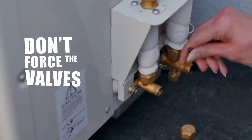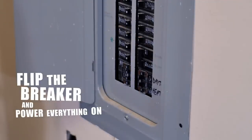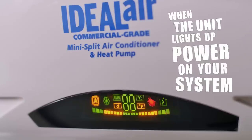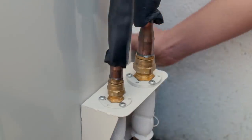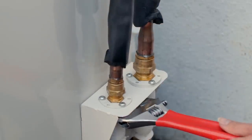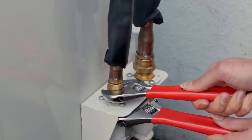Don't force the valves after you feel them stop. Finally, flip the breaker and power everything on. When the unit lights up, power on your system. With your system running, check for leaks on the outdoor unit by spraying some soapy water on the line connections. If you see bubbles, use your wrenches to tighten down the fittings. After that, you should be all set. I'm Chelsea Ray, and if you like what you saw, click the subscribe button below. Thanks again for watching — I'll see you next time.